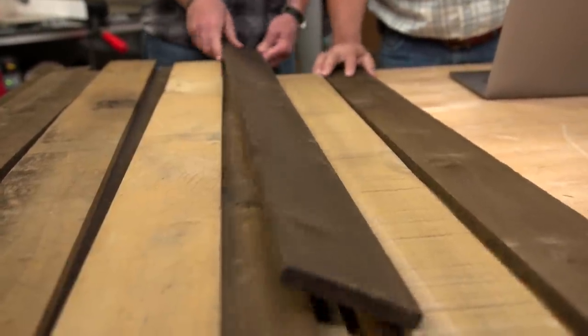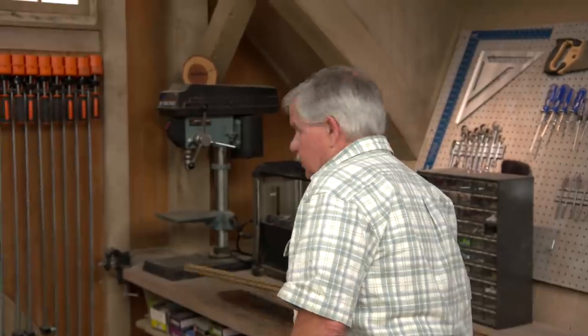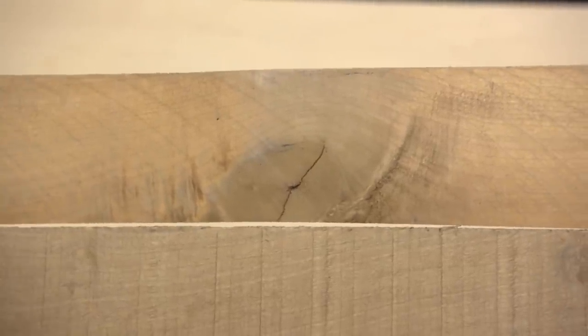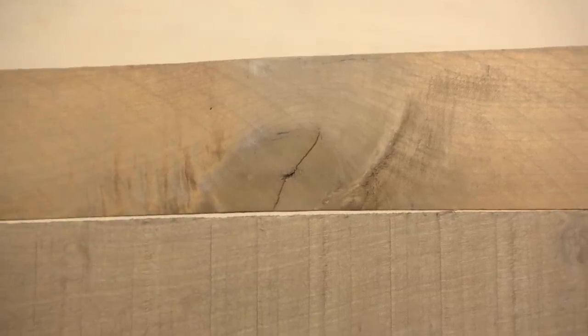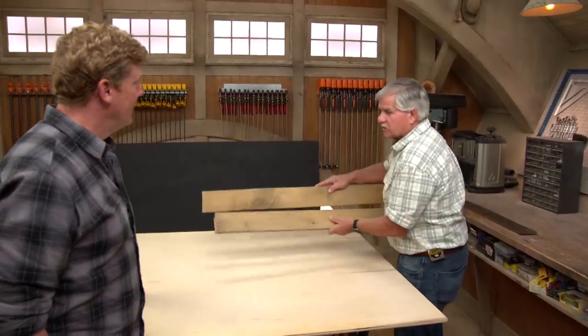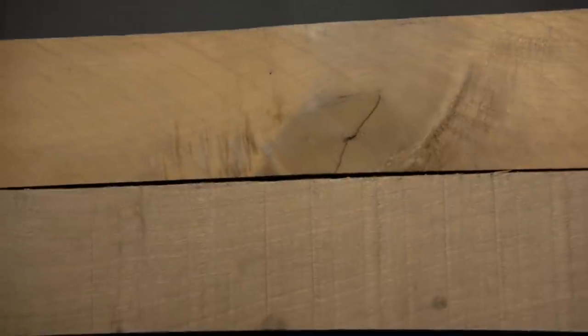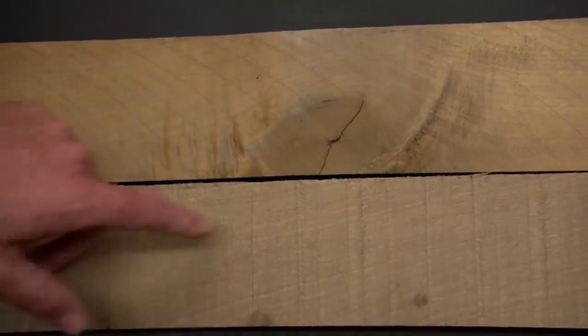We're only going to make a headboard because I've got a metal frame for the bed. We're going to start with this piece of half-inch birch. These are rough sawn boards, so when the boards go together like this you can see that gap — that's what you get with rustic wood. If you mounted this right on the plywood you'd actually see the white through the joint, so what I've done is painted a sheet of birch black, so when you look through the joint it just looks like a shadow.